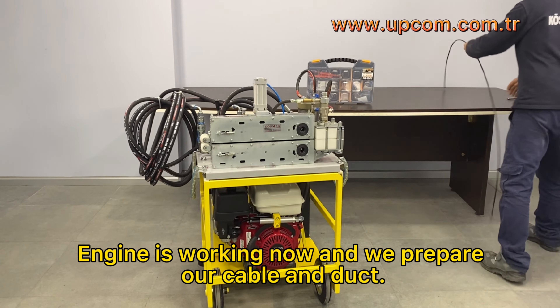We will run our cable through chain pallets and attach our telecom duct to the duct connection tool on the machine. Plastic rollers help keep the cable stable between the pallets and allow for easy cable insertion.